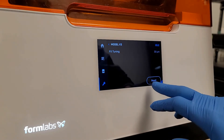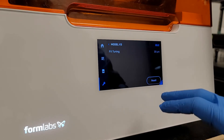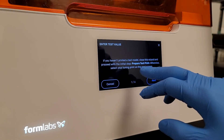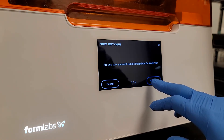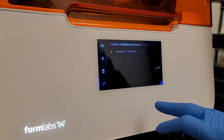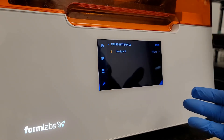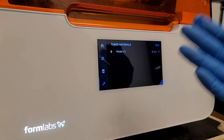You hit on it and you can reset it. Something important: if it has a tuned value already and you want to apply a new one, you should reset that value first and then apply a new one. I put in just plus 15 earlier and it didn't apply because it won't override the previous value. But now that I've reset it, I do plus 15, hit Apply, and go into Tuned Materials — we can see the test value of 15 is now entered. Any jobs moving forward uploaded to this printer with model V3 will now have that calibration value applied.